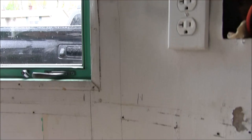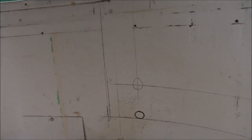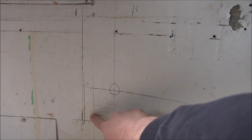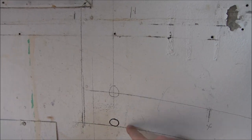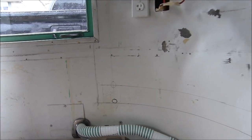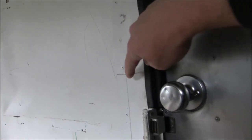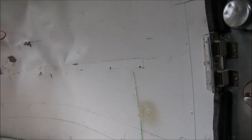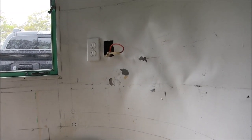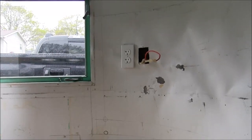Then I'm going to cut up, and last I'll drill out the rivets and remove the panel. I'm not cutting all the way over because there's a rib right here — I'm cutting right to here and going up. So when this panel overlays, I'll be able to rivet it down here and rivet across all the way on the bottom. That should get rid of the ripple effect. I'm going to drill out these rivets and slip the new panel behind it. You're going to see a seam right here by the door edge, so it's going to blend in pretty good and it's all going to be painted to match the new interior skin.